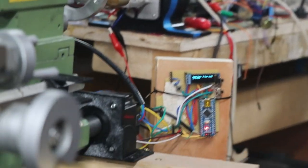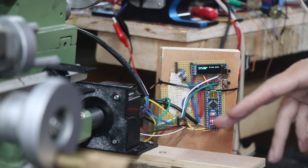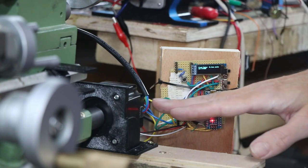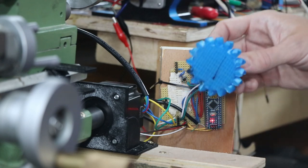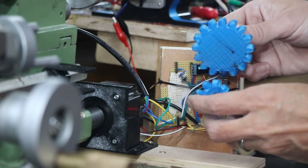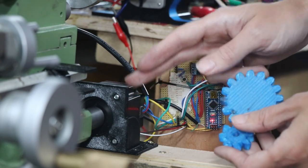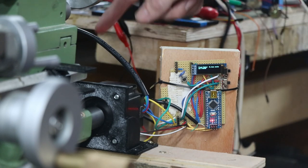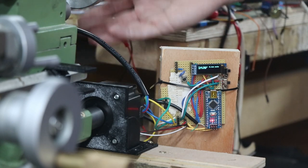Let's take a look at my setup. Here we have pretty much the main components in view. We have a stepper motor that is just straight coupled onto the end of the lead screw here. I've at various times experimented with a cog to couple onto the end so that I could mess with different gear ratios. Tucked back here is just the stepper driver unit — it takes steps and pulses.